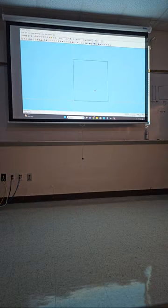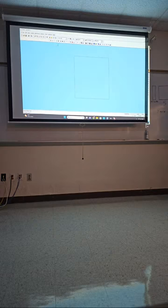So now, and this is a sub bar that we cannot practice. But after you do over here, we want to see the stock material. So what do we do? We go over here, we pause it. See over here, this is your kind of like your simulation for your machine. So you pause it. Processing at the bottom. It's processing. Okay. And then you go to view shaded wire. And now you have the stock.